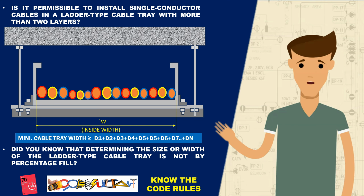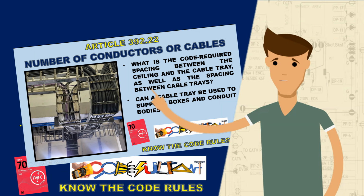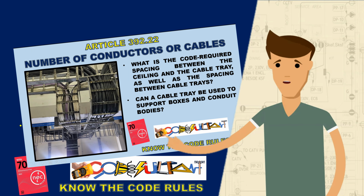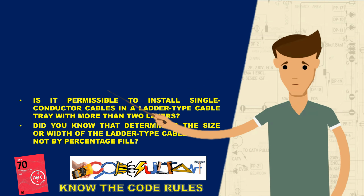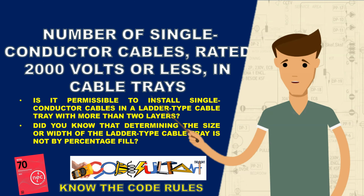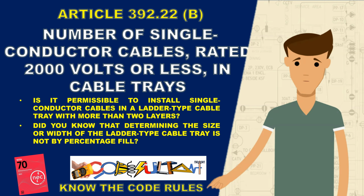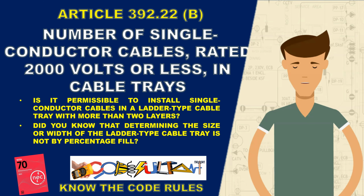Hello everyone. In our previous video, we covered the sizing of cable trays for multi-conductor cables rated at 1000 volts or less, installed in ladder-type, ventilated trough, and solid-bottom cable trays. In this video, we'll focus on determining the maximum number of single-conductor cables rated at 2000 volts or less installed in a single ladder or ventilated trough cable tray, as specified in section 392.22(B). We'll also go through fill calculations to help clarify these concepts.